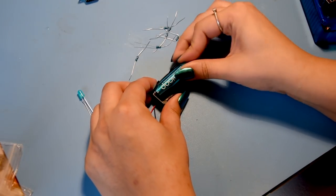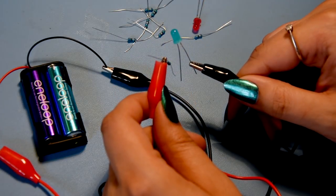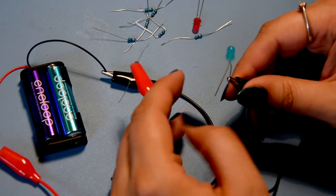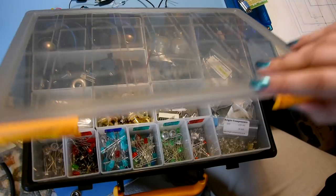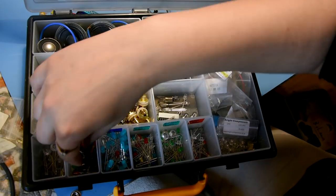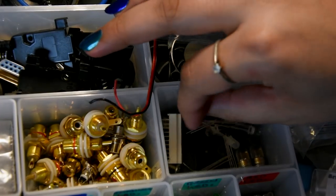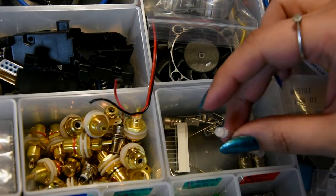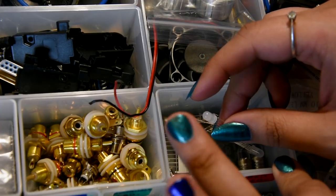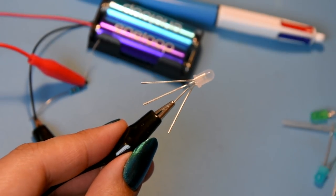So we have a 3-volt supply here and with some batteries it lights up - very happy. The resistors I've used are 50 ohms and that's just enough. Looking in my nice box of components to find a better color, I thought I'd use a bicolor LED for the two fire buttons so each button does a different color - I think that'd be nicer.